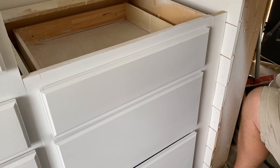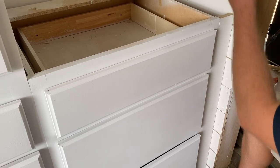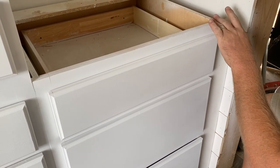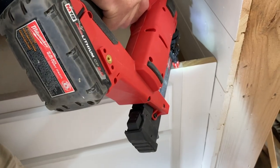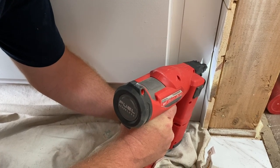Should you trim out the door first because the trim on the door is gonna be wider than what you've got there? No, I'm gonna trim the door flush right here and then maybe do some quarter round or something because we won't have a lot of room because of the butcher block countertop. Then I'm just gonna put this right to the shiplap and we'll silicone it and cover up the nail hole.